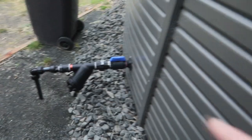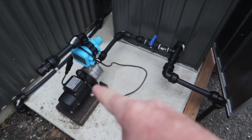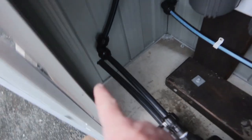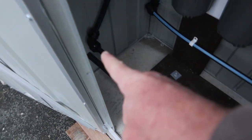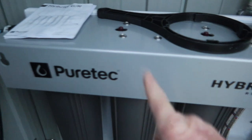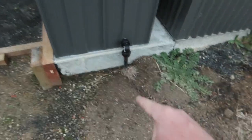I'll just quickly show you how it works. Water comes out of the tank, goes underground into the shed — or branches off around to the secondary pump. Once it comes into the shed, it comes in at the bottom, into the pump, the pump does its thing, goes up, over, then into the filtration system. It goes through the filters, out the other side, down, comes out here, and then goes underground over to where the house will be.